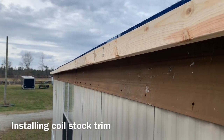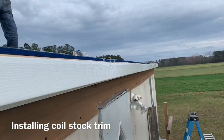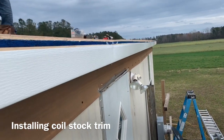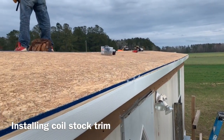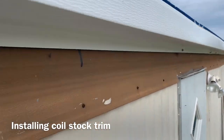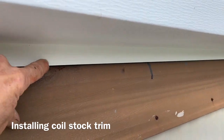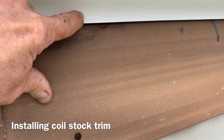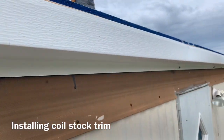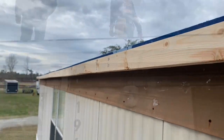As you can see there's a little swoop down there — you're probably going to have a swoop in this metal too. It won't really show up so much once you get it going. This is the way you want to finish off your mobile home plywood — let it hang over, run a two-by-four back here, screw it down through the plywood, run some fascia metal from here back to the trailer, and then an inch and a quarter down here so if you need to flex it in or out a little bit somewhere you've got the ability to do that. DIY, baby — all day — you can do this!